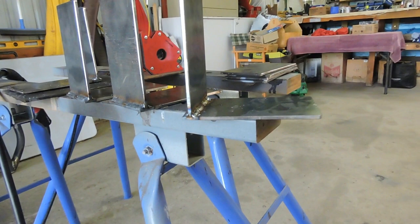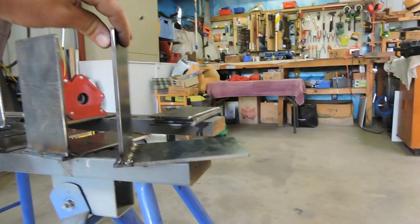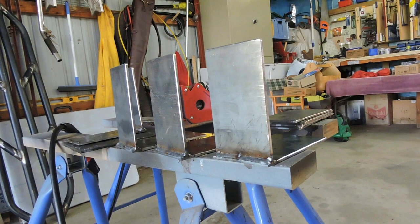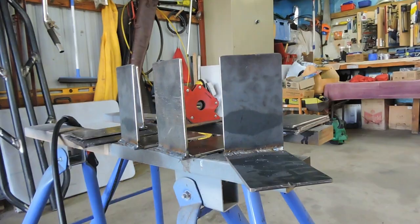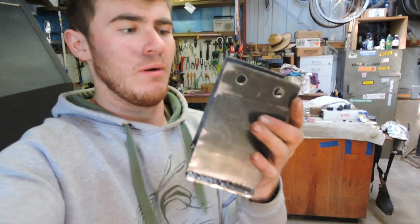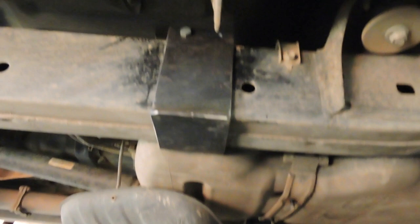The overhang is about 8 mil so I'll have a matching 8 mil on the other side - nice strong welds on both sides. I rotated the heat, doing 50 mil chunks front and back to try not to warp it out of square. I'll scribe the top of the chassis with a sharpie, drill two holes so when it comes to welding I can put a drill bit straight through. The brackets have a 12.5 mil hole and are welded inside and out. On the passenger side it's a bit awkward because of the fuel tank, so I might end up with just one bolt in that side permanently.